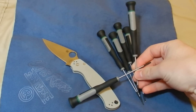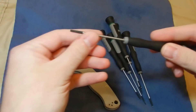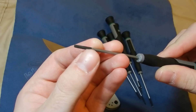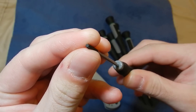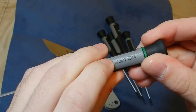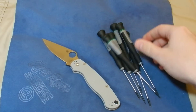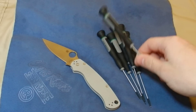I've gone through a bunch of Torx sets and these are the best. A lot of Torx sets you get will be cheap Chinese pot metal — not hard, not treated. This set is actually pretty good metal, not soft at all, and it's coated with what seems like almost a diamond coating — really grippy and really hard. The markings will wear off eventually, so I mark them with a silver Sharpie. The most common sizes you're going to work with are T6, T7, T8, T9, and T10.